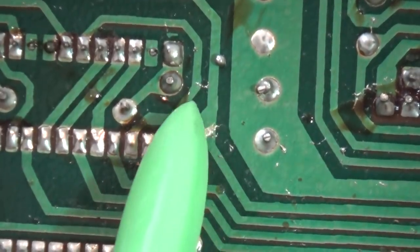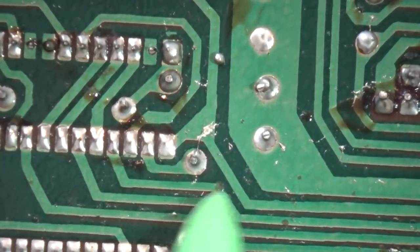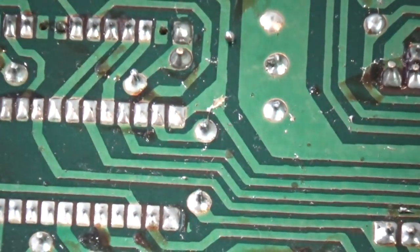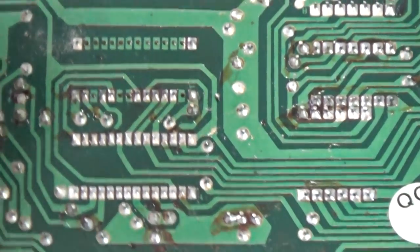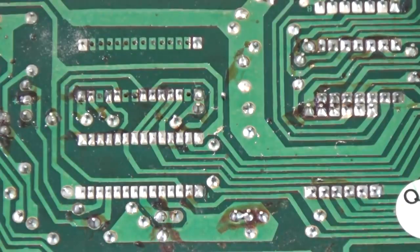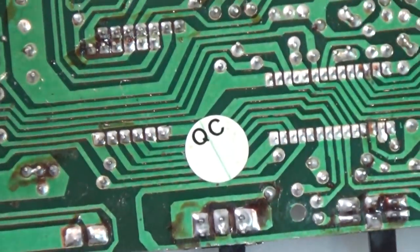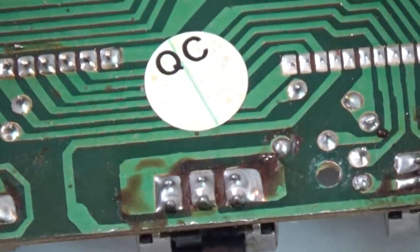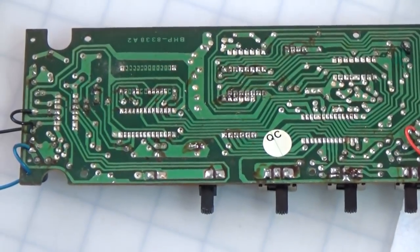And look at this too — there's a little solder ball right there, just stuck to the PC board. Look at the solder here, protected by the solder mask, but there are solder whiskers everywhere. This is just the worst soldering job ever. This chipset was not cheap — it had to be among the pricier chipsets of the time. A single-sided board cuts costs tremendously, but jeez. And it has a quality control sticker, but there's nothing written on it. Quality control? Maybe not so much on the circuit board.